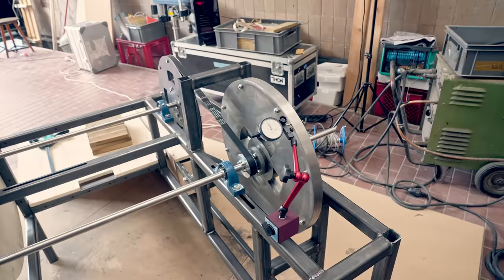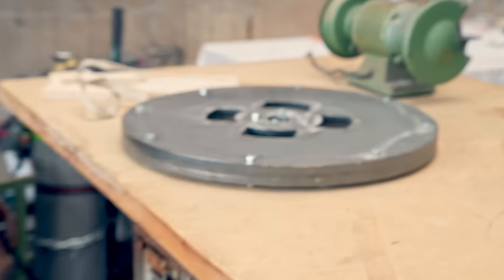There's the highest spot. Now we spin the wheel again — one millimeter, two, three — 3.9 millimeters, which is a huge run out. This wheel is very wobbly. I will replace this entire wheel with our other wheel, this one.